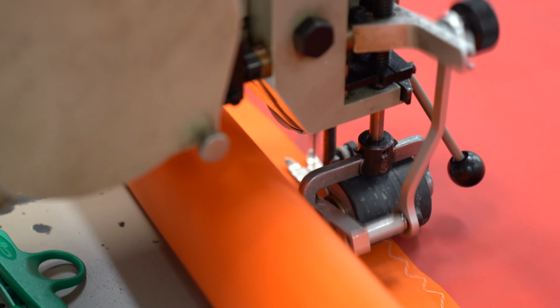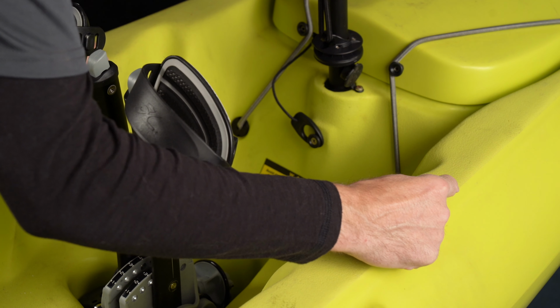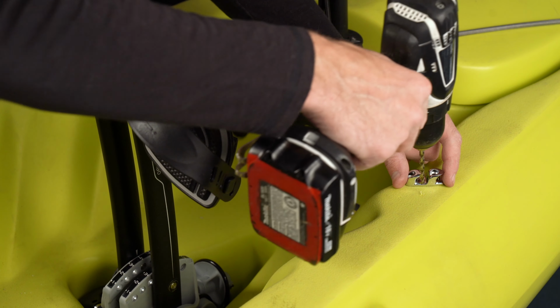To install the Fairlead, make sure your direction is correct. Your line's gonna be coming from the back of the boat, running through each of these into the furler. And you want to pick a spot that's a little bit of a diagonal. Just kind of visualize your lines coming in and exiting. Find your location. I'm going to take a smaller drill bit and just mark where these are. And then with a 3/16, I'll drill out these two holes.